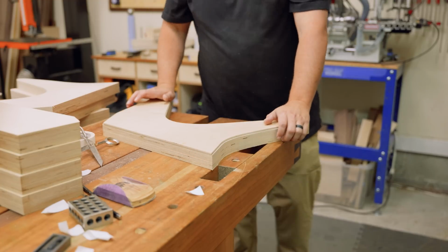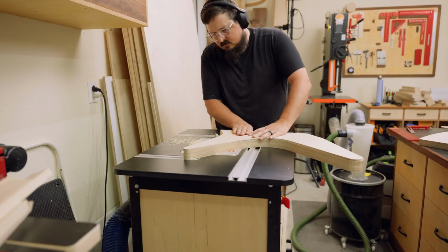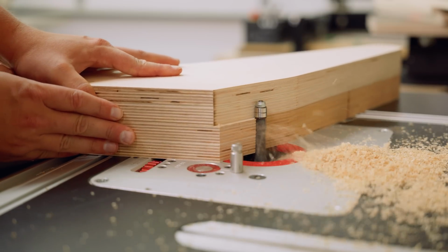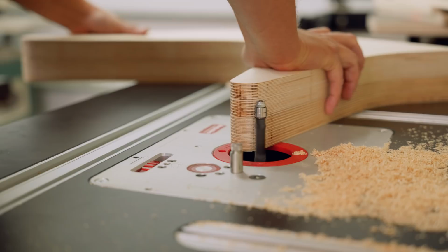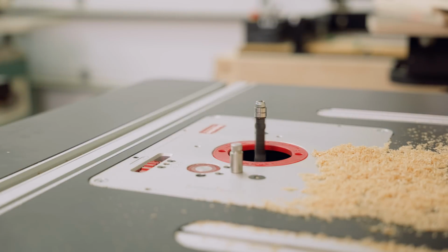Once I had re-roughed all my parts, it was back over to the router table to re-Jenny Craig the workpieces. And this time, I'll keep it off. The only big change I made with this process was instead of using the templates for every part, I used my templates to adjust one workpiece and then use that altered piece as the guide. This way, any changes to the alignment were easy to correct.